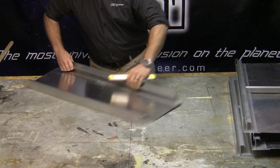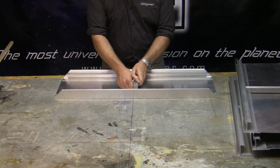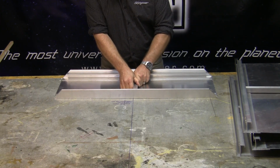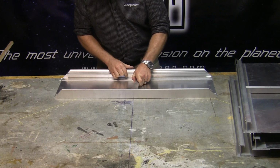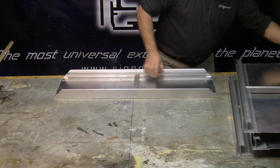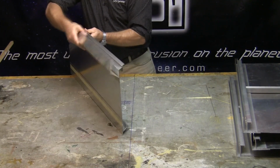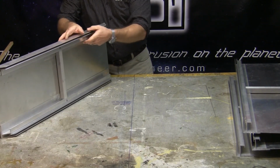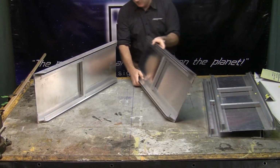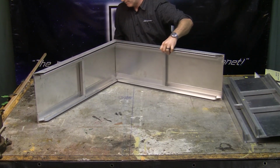These 1-inch tubes that we're placing in here, on an average, I'd say, depending on what part of the country you're in, 24 inches on center would be more than enough. Okay, now that we've got this, we're going to take the four sides and tape them together and make the outside perimeter.